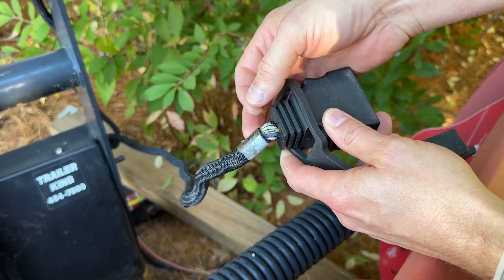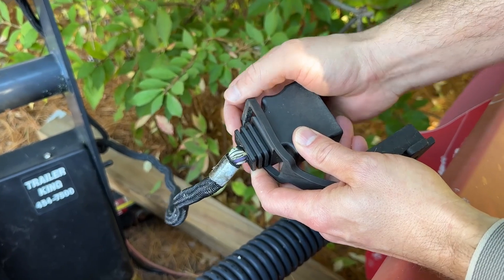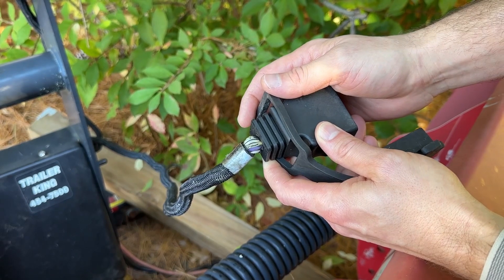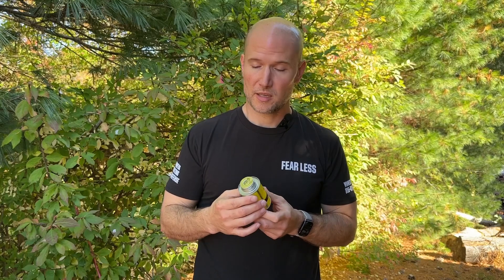Two, we could cut this back, cut each wire, and slip over some heat shrink tubing — no thanks. We could wrap each one with tape, but that's going to make a massive bundle. But I have another solution I'm going to share with you, which I'm betting you've probably never seen before. We have here a can of liquid electrical tape. It's designed for when you make a butt connection or crimp or something like that, to weatherproof that connection and seal it. But you can also use it to seal broken insulation on wires.